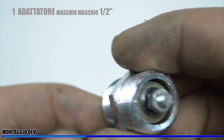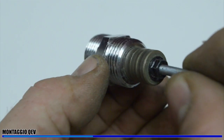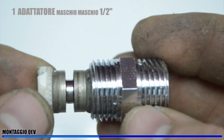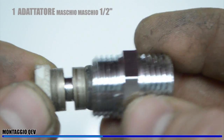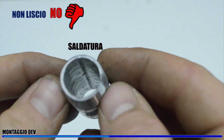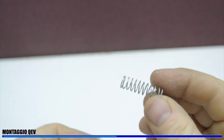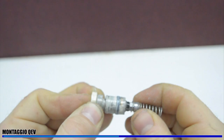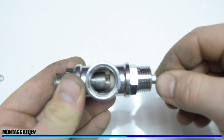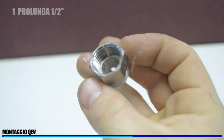Remember, this little piston has to slide inside a half-inch adapter. It's very important that the black rubber we did earlier doesn't have to be very precise — it has to leak a little bit of air so that air can pass behind it. Almost perfect. When we choose this piece it's very important to take it smooth, without any welding strip, because it has to slide inside very easily. I put some oil on the piston and behind the piston a small spring that pushes it on the front.